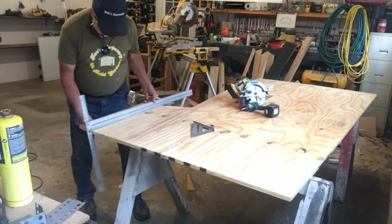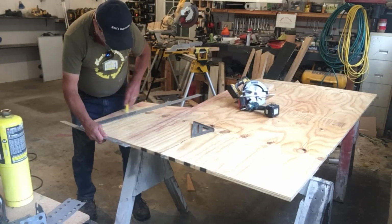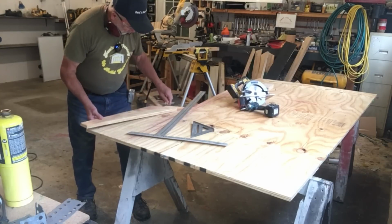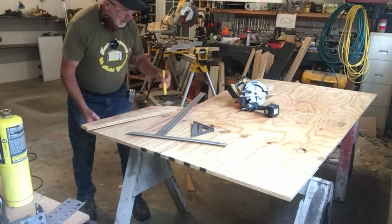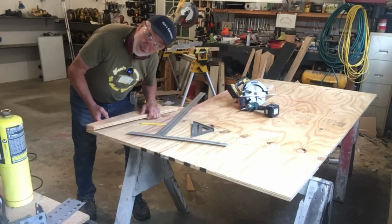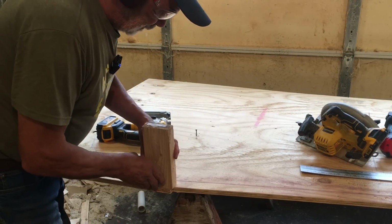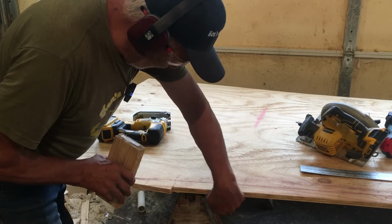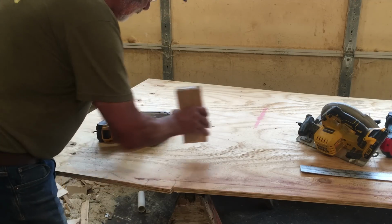I think that'll stay there. I'm not convinced. I think I got it. Good. So we're just keeping that little sliver. I'll cut that off so that we can use this as a template. And then I have to cut the, well, why don't we cut the roof right now? Good thinking. Where this subfascia is going to be, it needs to extend in the thick to the depth of this side of the plywood. So I'm going to cut that out and then cut the roof line.